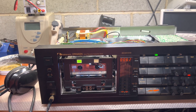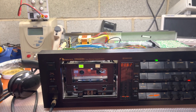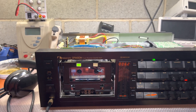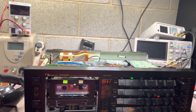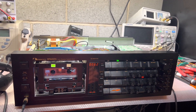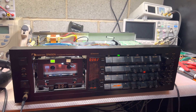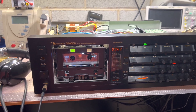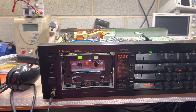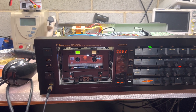Now the Dragon plays other recordings beautifully — this tape plays so well now, it's unbelievable. But it took about two weeks of digging in and tuning all my decks to make sure they all match — matching the recorded tape, matching my azimuth tape, and matching recordings between them. When I record 10 kHz on one deck and put another deck, same amplitude and same phase. That's how you can make sure your deck is performing well. Thanks for your attention, hope this helps you.